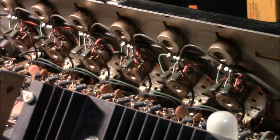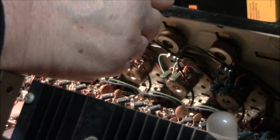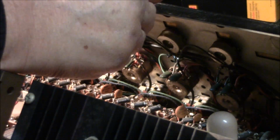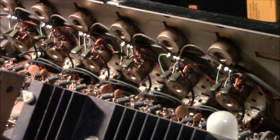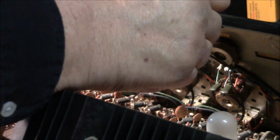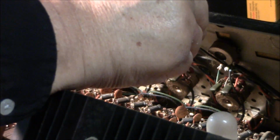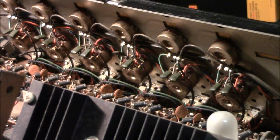And I don't want to disassemble this thing and add more time to it, but if this doesn't work, what we'll have to do is take the connectors off the pots and get in there and open them up and put some of this in there with it. Which normally is what you do in this circumstance, you spray. This is a very old amplifier. I don't want to do any more harm by spraying in contaminants and fluorocarbons and junk that's inside of the spray DeoxIT.